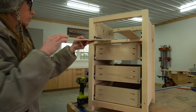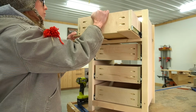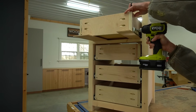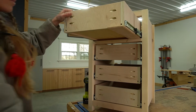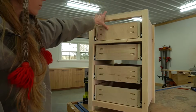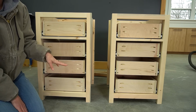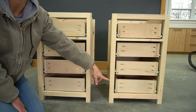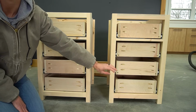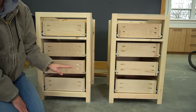And just like with everything else, this is always a little easier when the drawers are individually framed out. In those cases, some scrap 1/4 inch plywood underneath the drawer is all you need. These two cabinets are exactly the same. Same size drawers. The only difference is that for this cabinet, I use the drawer spacing method about the drawer fronts plus 1 inch. And in this case, I lined up the bottom of my slides with the bottom of where the drawer fronts will go.